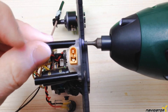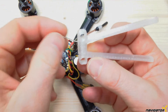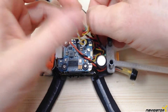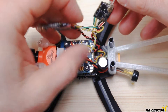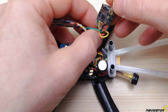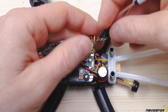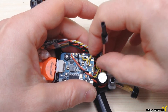For the spacers, normal screws are fine. The antenna goes into the antenna mount. The 3D printed parts are available for download at Thingiverse. Sort and stack all the wires and components as good as possible — space is a luxury we do not have. Leave some space to reach the USB plug, which is on the back. You can turn the flight controller so the USB plug is on the side, but then so will be the ESC plug, so I do not recommend that. Remember that components such as the VTX will get quite hot and will need some space and airflow for cooling.